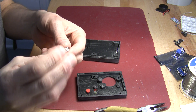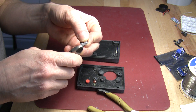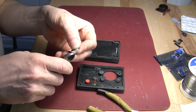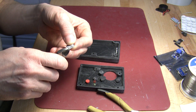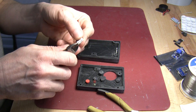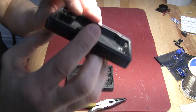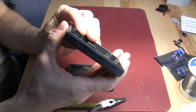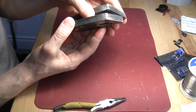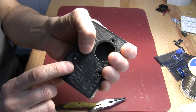Regarding the micro switch, you'll need to cut just a tiny bit off the very ends of its three feet so it fits well inside the enclosure. The idea is it has to sit low enough so that when you put the top with the red button inside and close it down, there is no play but it clicks.